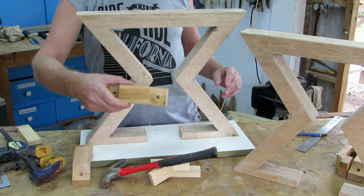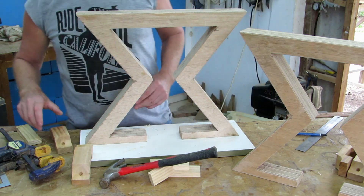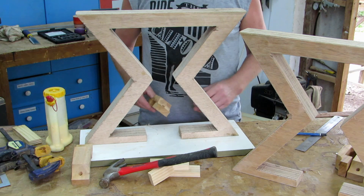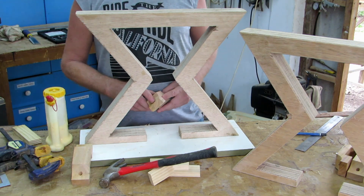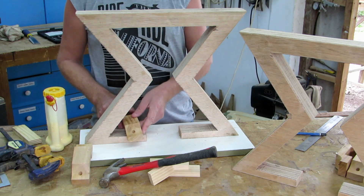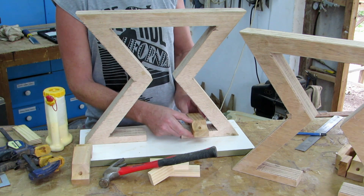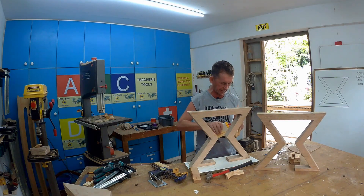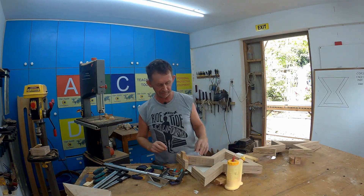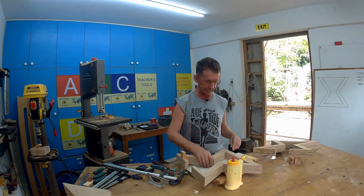I've made up these mahogany brackets and I'm going to glue them in here. When normally putting legs to a table, you don't actually glue them - mostly because of expansion and contraction - but in this case I don't want to glue the legs to the table in case you want to remove them. So they will have four screws in each leg. The bracket is going to hold this - it's slightly away from the table, maybe less than a millimeter, and it should pull in tight. Glue is mainly to hold it in place rather than for actual strength. We'll finish sanding it up, give it a coat of primer, and I already pre-drilled these holes because it's easier to drill them now than later.